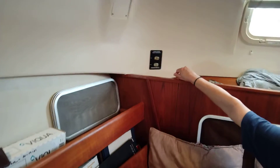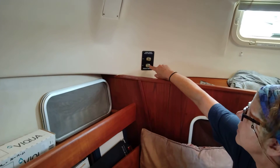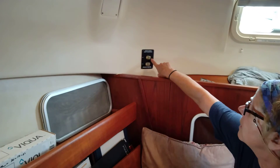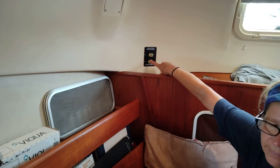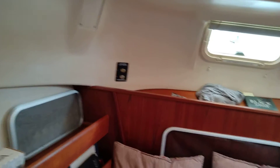Now you're in your slip and you've hooked up to shore power. Make sure these breakers are on the left position like they are now — that means you're on. If they're on the right position, you're off. Line one is for basically the lights and everything else. Line two is strictly for your AC and your heater. Line one is panel A, line two is panel B.